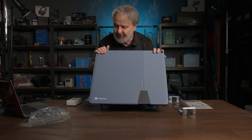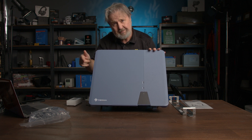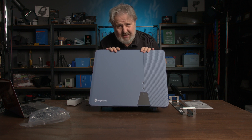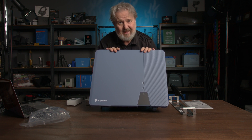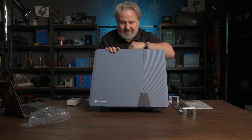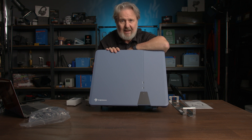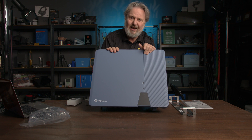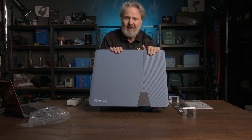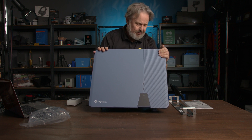There's no on-screen display because you've got a Wi-Fi dongle and an app. Frankly, as much as I as an installer love an on-screen display when commissioning a system, after that the customer probably only looks at it a handful of times before they forget about it. They're more interested in reliability and performance over time. An app gives you way more detail — self-use, how much you're exporting to grid, importing from grid. The analytics an app can give you is way more than what you'd get on an on-screen display.